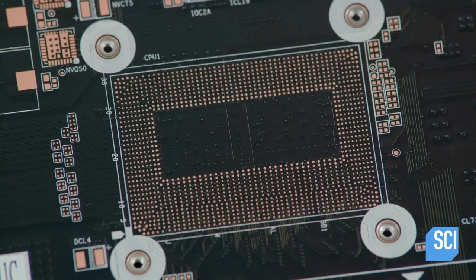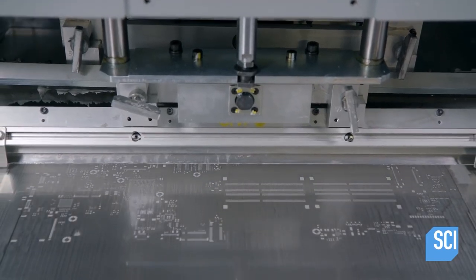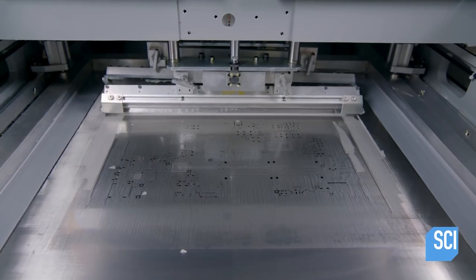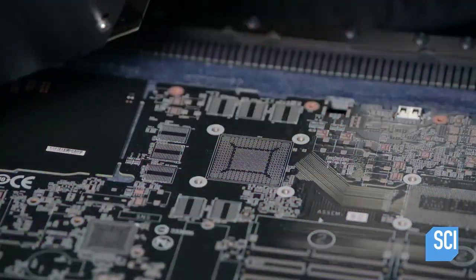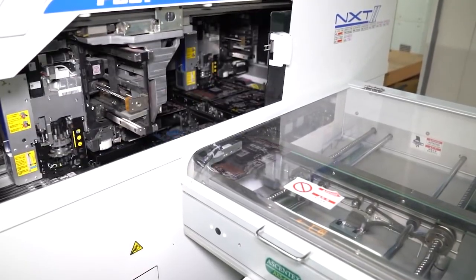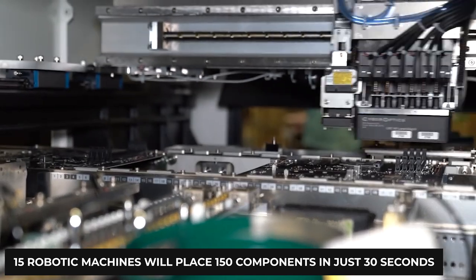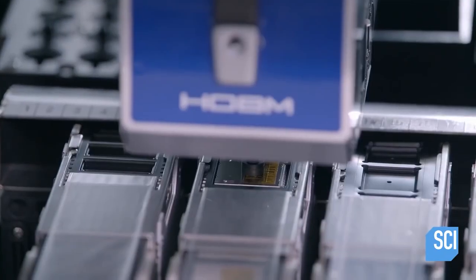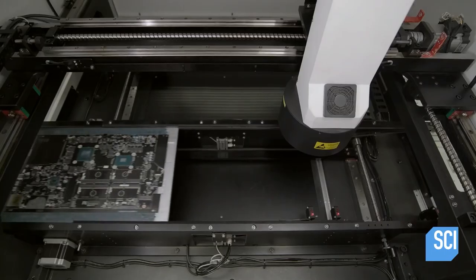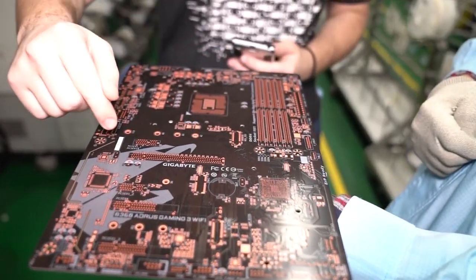The life of a motherboard starts as a printed circuit board. The copper wiring forming the electric components of the circuit is soldered to the board. A machine then places a stencil of the component layout onto the board and solder paste is applied to its openings. A quality inspection camera captures images of the solder paste and sends them to a system that analyzes the photographs to determine any missing paste, misalignment, or other errors. Only if the board passes this critical inspection will it be allowed to pass through 15 robotic machines, which place 150 components in the appropriate locations on the board — all in just 30 seconds. The board is then passed through an oven where the solder paste melts, causing the components to stick firmly. After another camera inspection, functioning tests, and visual inspection of the internal processor, the motherboard is moved to the assembly line.